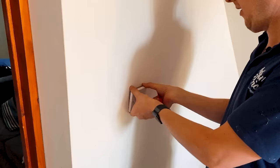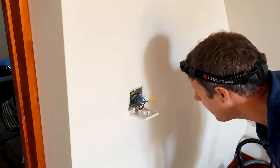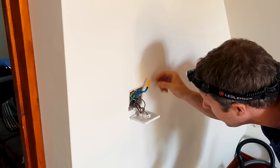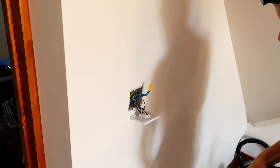Okay, I was right about the neutrals to the switches. They've done it in a bit of a funny way - they've put these crimps on, which is not great. I can't see any damage to the wires though, but it can so easily be something as simple as the neutrals being pushed too hard into the back and shorting out with the back box. I'll just check this now and see if we've got a better reading or if it's still shorted out.